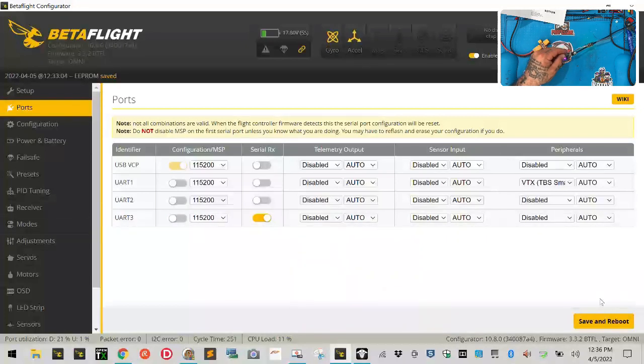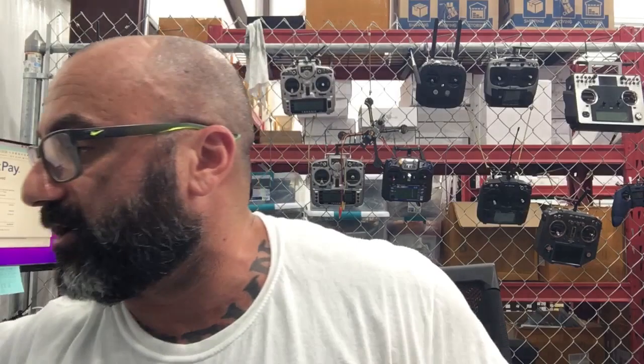So that's all that you're doing, guys. That's how easy this is to get it working, and that pretty much does it. If anybody tells you that you can't run TBS on an Omnibus F3 board, they're wrong. This has been updated to firmware version 6.17, and I made sure to do that earlier to make sure we were testing the right firmware for the TBS receiver.